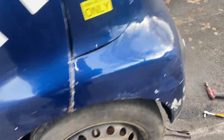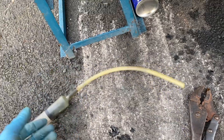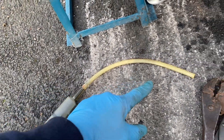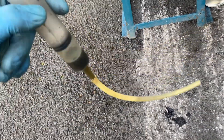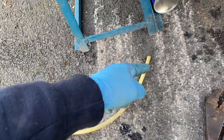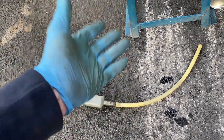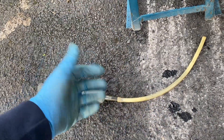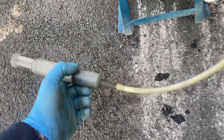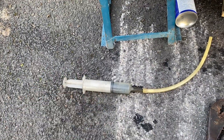I'll just explain the process a little bit — the bleeding. This is just something I've made up but it works: if you attach a clear tube and a syringe with some brake fluid to a bleed nipple, and you make sure it's full of fluid and pointing upwards so any air bubbles go upwards — you can see it's got loads of air in it that's come out of the brake system. Then you just pump it a few times and it'll push the air out and hopefully won't suck any air back in. It's sort of like the old milk bottle trick but developed further. Anyway, unless it's still not right on a test drive, that should be it for this one — don't forget to like, comment, subscribe, check out my other videos, and see you next time.